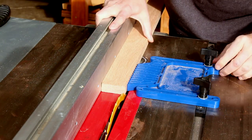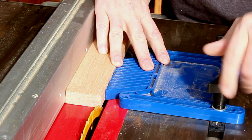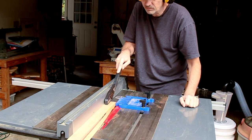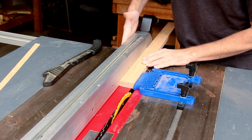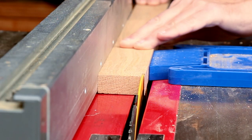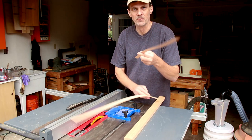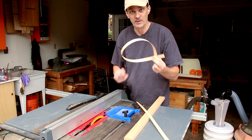I'm going to bring a feather board over just to where it's touching the board and I can lock that down. And for each strip, all I need to do is move my fence over to where the board touches the feather board. And that gives me some very thin strips of wood. Now I just need to repeat that a bunch of times.